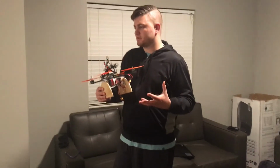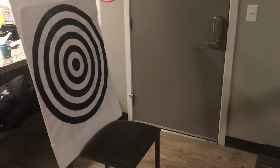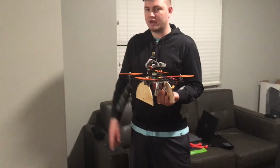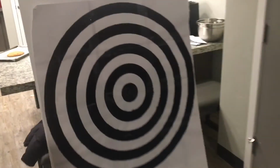The biggest circle that we find should be the radius of the target, and the center usually ends up being really close to the center of the target. After that, we know where the laser is pointing. It's usually in the same few pixels. So if we get it pointing really close to the center here, it decides to fire.